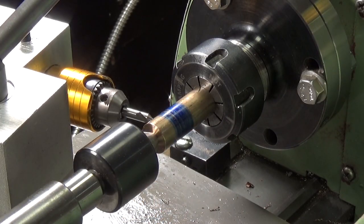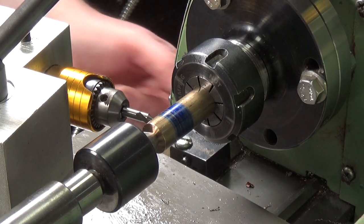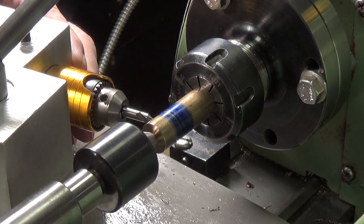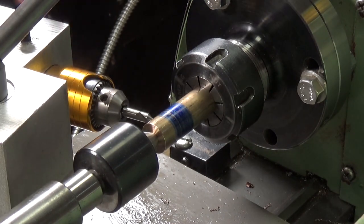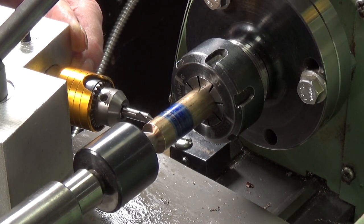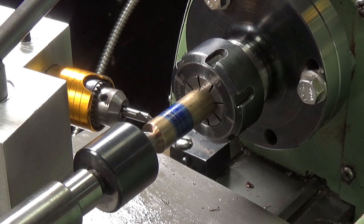This is the setup for drilling the hole for the grub screw. It's not actually square — it has to go in five degrees off the perpendicular. The reason is it goes all the way through the pulley, which is also threaded, and that lines up with the threaded hole in the bush. So I've got my compound set to five degrees off perpendicular, with the cross-filing block lined up square to the compound, and I'll just wind it in — pecking away, hopefully it will work.